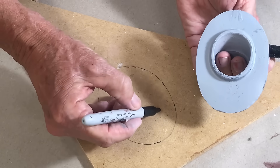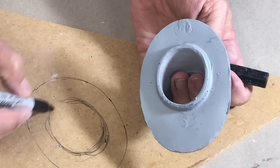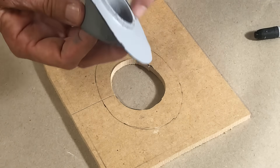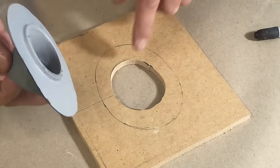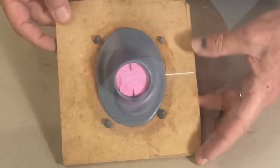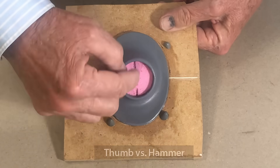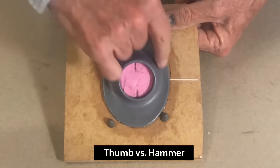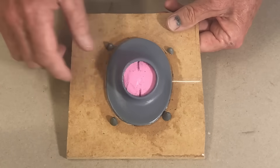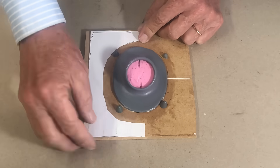I'm going to make a base on it now. I cut the hole. The next step is to glue down the original down on this board that I made. I made some keys and glued them in place, and I also cut a keyway in the top of this. I also put a little bit of Vaseline on it because it is silicone — silicone sticks to silicone and we don't want that.